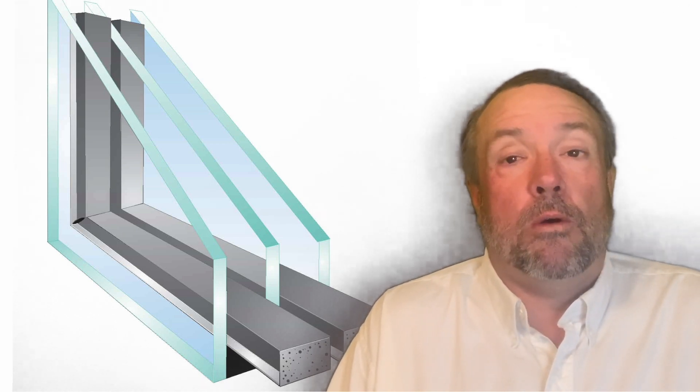The best way to use and keep heat is to use the cheapest double-pane material you can get your hands on, and then put a blanket over the transparent area at night when there's no solar heat coming in. If you have a thermal battery — a north wall or floor retaining thermal energy — you'll get through the night a lot easier. Going from an R1.5 or R2 up to an R7 or higher with a really good insulated blanket — that's what we're going to talk about today.